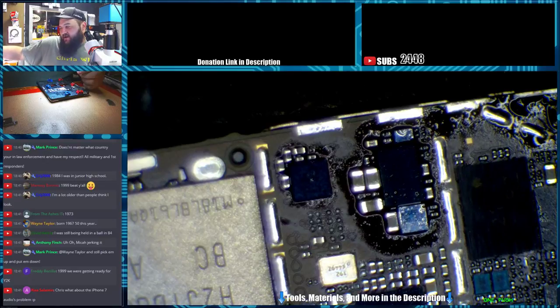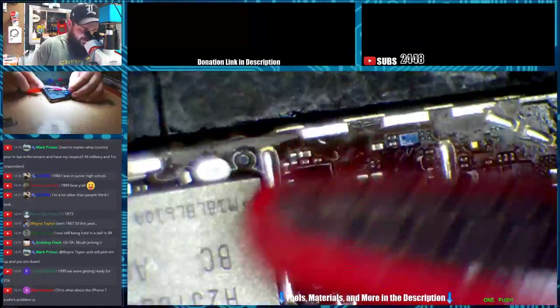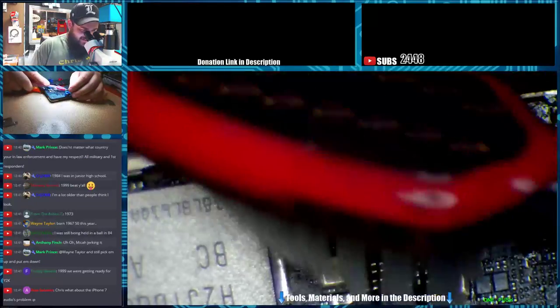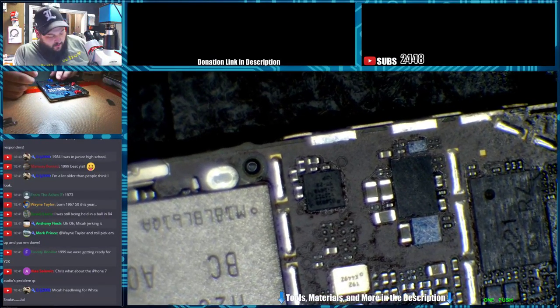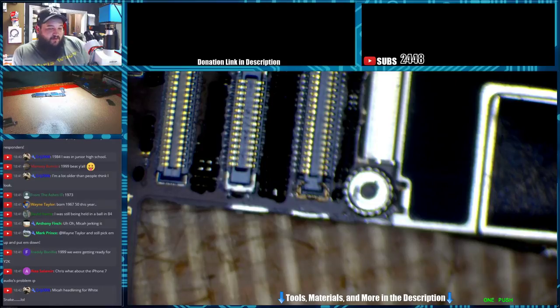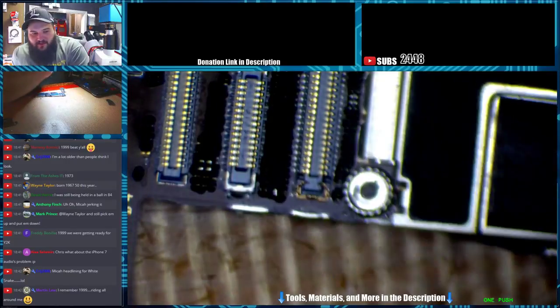The audio problems, the ones I've seen, I haven't found a solution for them. All the ones that have had audio problems, if we couldn't downgrade them, I told them to take it to Apple. Apple did something after that update that has really fucked with a lot of phones, and I don't know why some of them haven't returned to normal. But it's definitely caused some problems because we've seen much more issues after iOS 11 than before. We had seen a few iPhone 7s that had drop damage where they wouldn't boot. But nothing with touch, nothing with audio, nothing related to that.